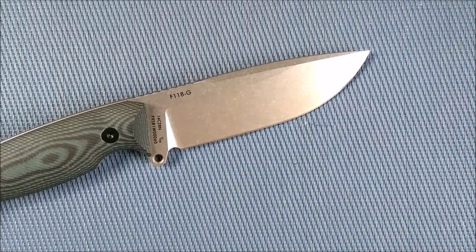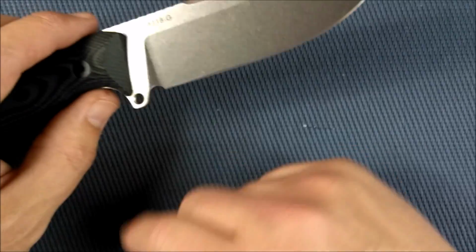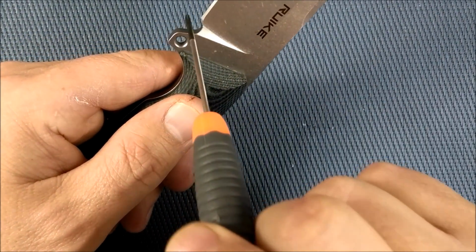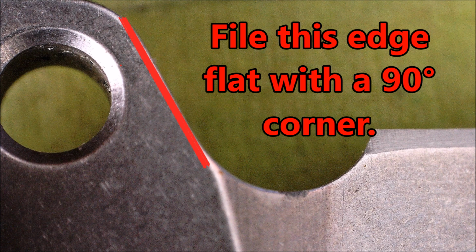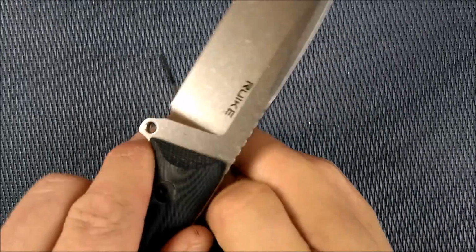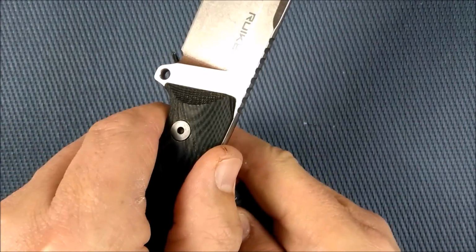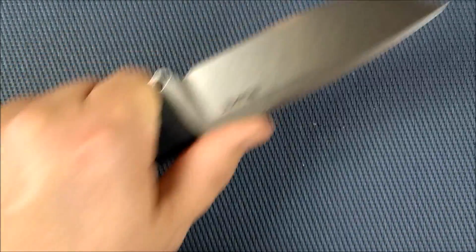And so if I would want this to be a true survival knife, I would need to make a flat edge somewhere that I could strike it on. And where would I do that on this knife? Well, the spot that I would choose, I think, is right here on the inside edge of this guard, this edge here. So if you make that edge sharp, then if this is a ferro rod, pretend it's thicker, I could still hold it on my hand and strike across this way, not striking on the cutting edge because that's no good. But I could make sparks like this without making anything sharp where my hand goes. And I still have a sharp edge that I can make sparks fly.